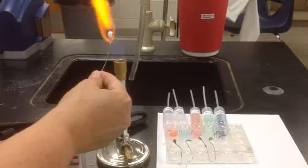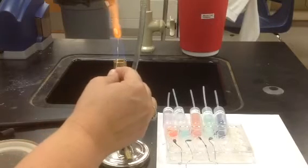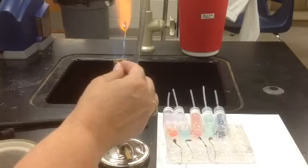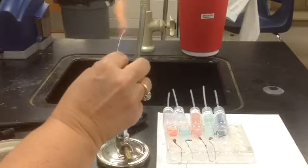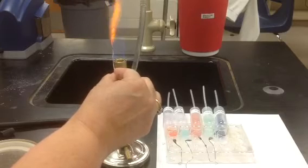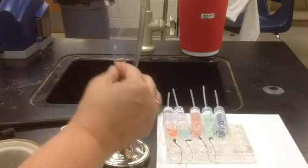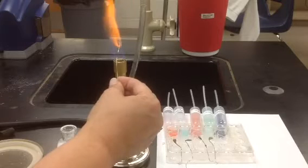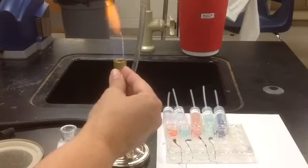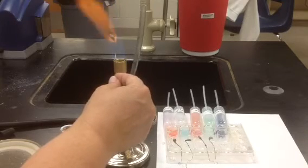It's going through what I call the popcorn stage, where it looks like it's puffing up white — that's what I think it looks like, popcorn. You want to heat it until it gets to what I call the lava stage, where you turn that solid white powder into a grayish-red liquid in the end of your nichrome wire loop. You want to keep it in the outer edge of the flame until the liquid you have on the end from the borax turns fully into liquid with no more solid powder in it at all.